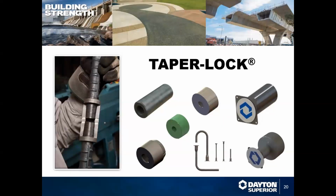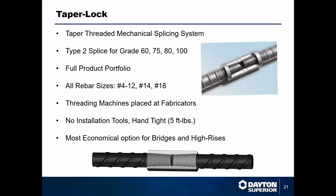Next, we have our taper lock system. This is what I would call the Cadillac system of our threaded couplers. Essentially the way that I always explain it to people is we have a machine that is a pencil sharpener for rebar. It's a great machine, puts a thread on the end of the bar, allows fabricators to do this themselves. And all you get from us is the coupler, but it allows you to control the bends, allows you to control the production speed.